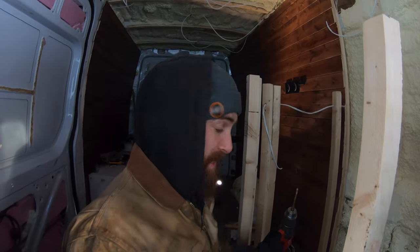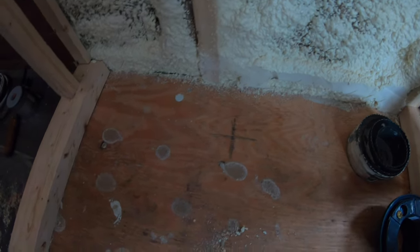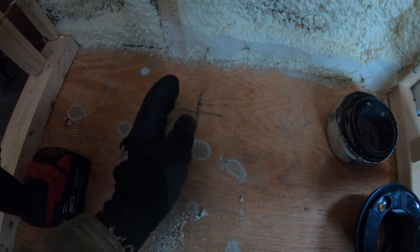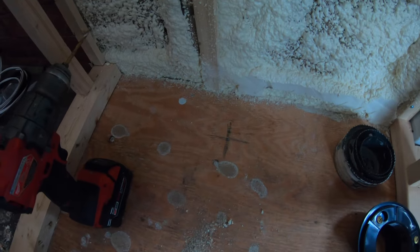The drill bit I'm using is 7/32. I have a mark here. I went on the underside, and there's a main beam like right here. So I'm gonna be over here with my drain. I'm probably actually gonna drill it here, not there, but we'll shoot the pilot through, see where it ends up. You see daylight. Let's go check, see where it is.